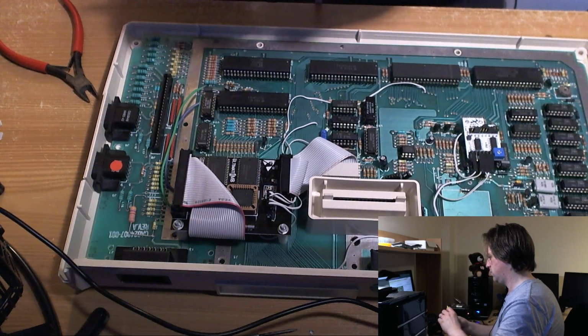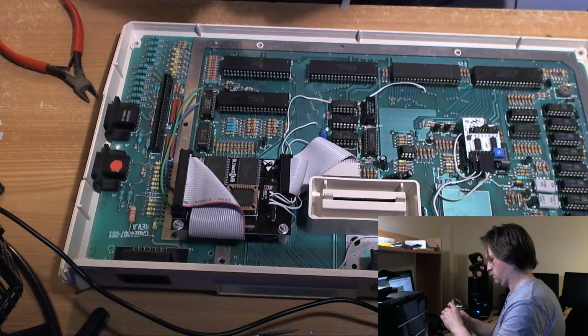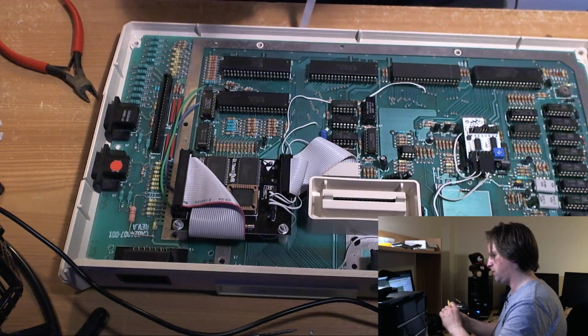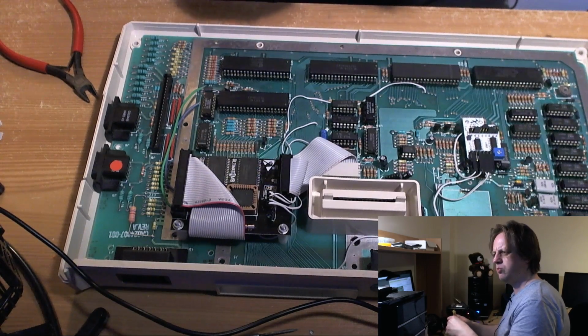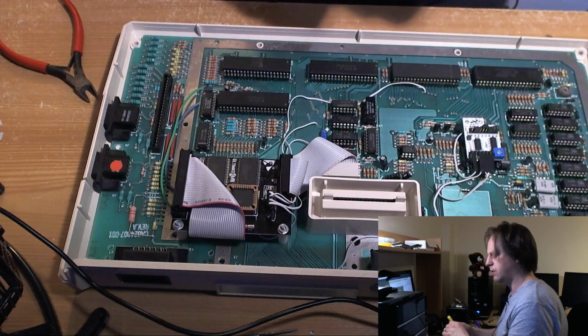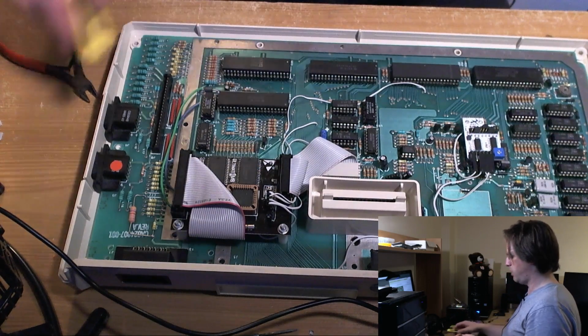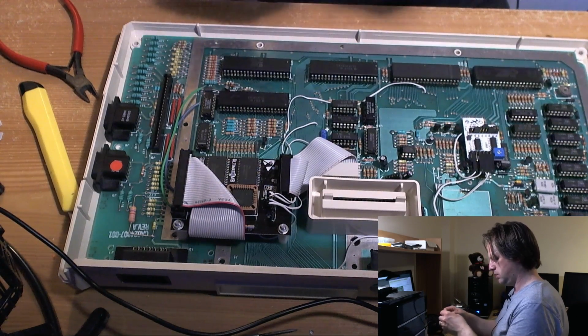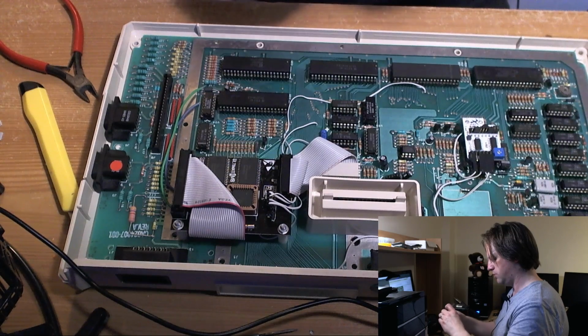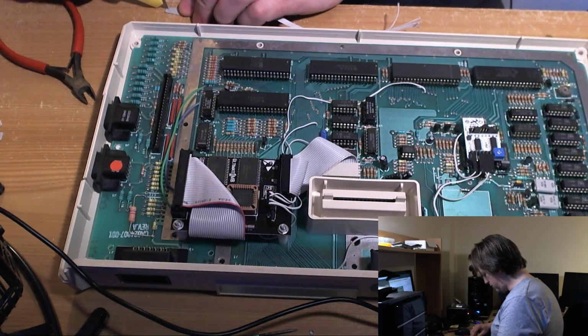And the S drive bootloader. I was really surprised to find that the drive mounts in S drive don't survive a reboot. I found that strange. So you mount or launch an ATR from the bootloader, and then if you reboot into Sparta-DOS X, for example, the drive isn't mounted anymore. I found that very odd.